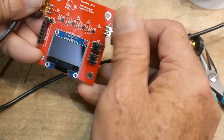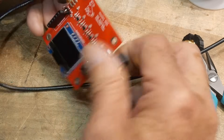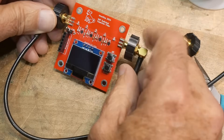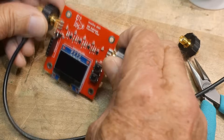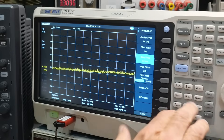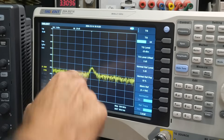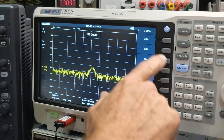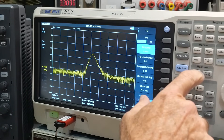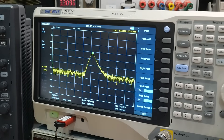Maybe we can power it up and see if there's any difference. To use these things, you just have to write a 6-bit word to each device to set a capacitance level. I have a spectrum analyzer with input, output, and tracking generator. Let's set frequency to stop at 300 MHz. Turning the tracking generator on, we can already see it's doing something — there's zero dBm output and a peak at 155 MHz. So it is acting like a filter.